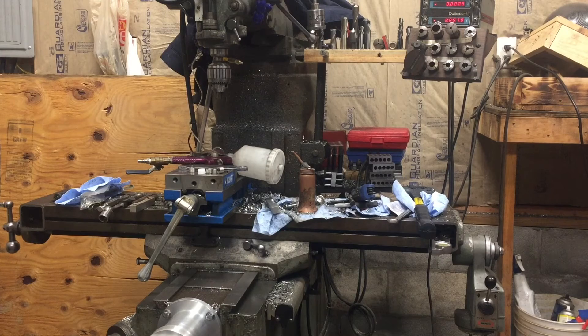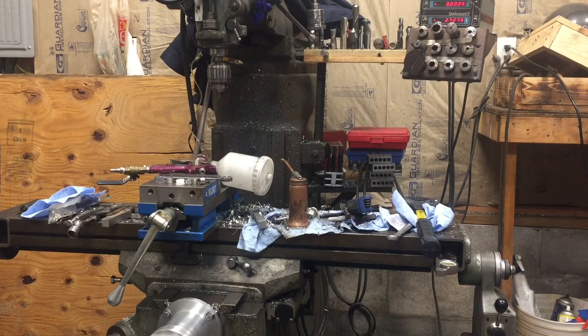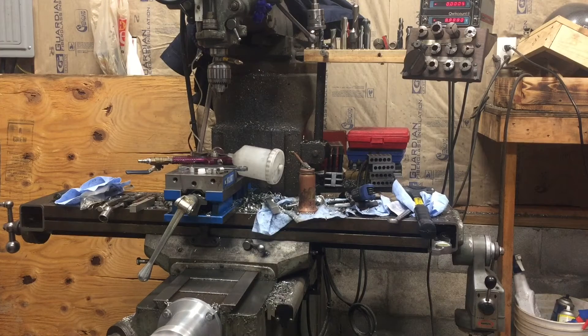I do have the Masso unit set up in the cabinet for this machine. I'll be getting it on video in the next couple of weeks around Christmas — I might have a little time off from work. That's the ClearPath Servo on the Bridgeport — it moves right along and has no problem going where it wants to go. According to a calculator I've done, I should have about two thousand pounds of force on the table with that ball screw combination.